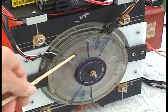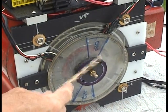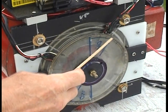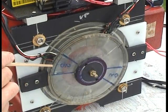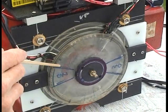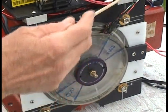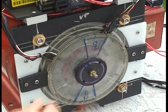This is the timing disc on the back of the motor. As the motor spins, this revolves. There's a row of small magnets right along here that create a full-length magnet effect. The hall effects right here and right here will turn on when that passes by. I have two hall effects at 90 degrees, so it'll pulse this bank — the top bank on the right side — then comes around and pulses the other bank on the other side. So you can create an AC current this way when you have the discharge of the two capacitor banks going in opposite directions.